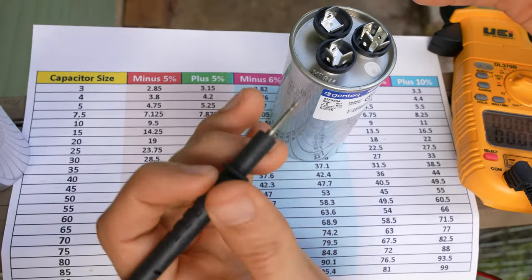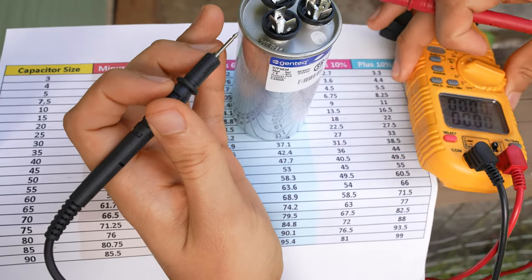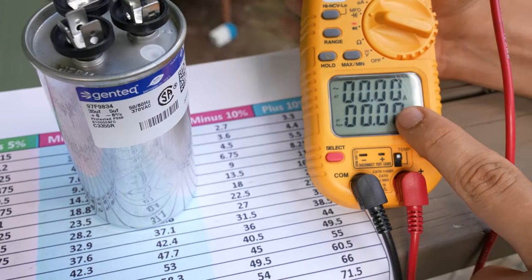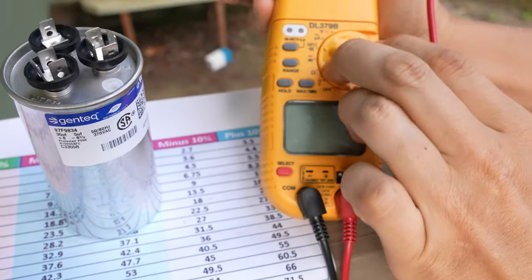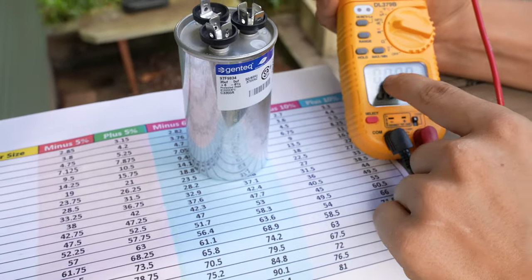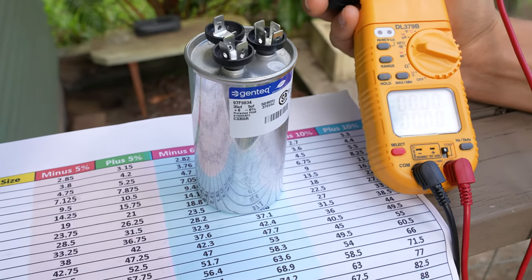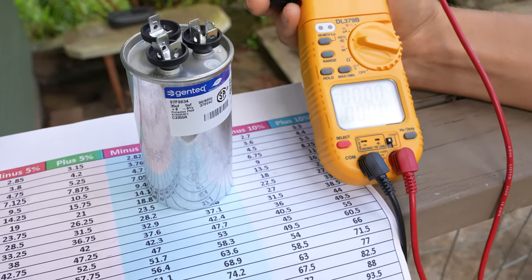Let's go ahead and check our other capacitor. Just yesterday I was checking a capacitor and my readings on the meter were all over the place — 400, 350, 380 — just bouncing around and the meter would not stabilize to just one reading. All I did was turn off my meter, turn it back on, and the next time I measured it everything came out fine — about 41 microfarads. So if you ever have any funky readings, try resetting your meter or replacing your batteries. It's unlikely, but sometimes the meter itself could be bad, and unfortunately that you cannot reset.